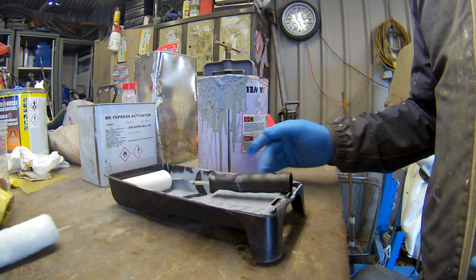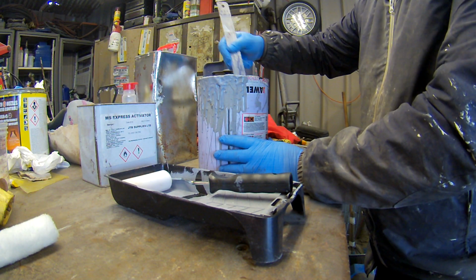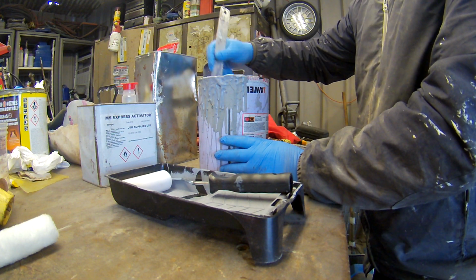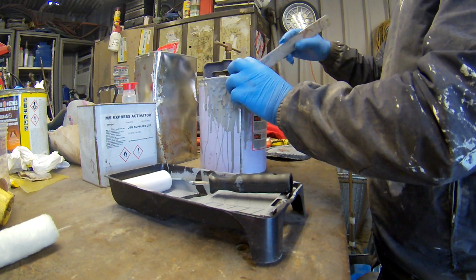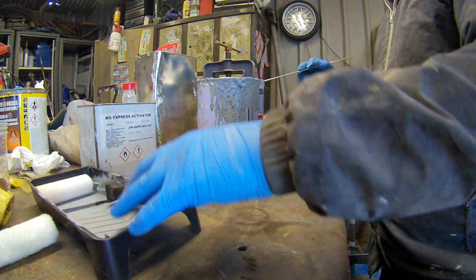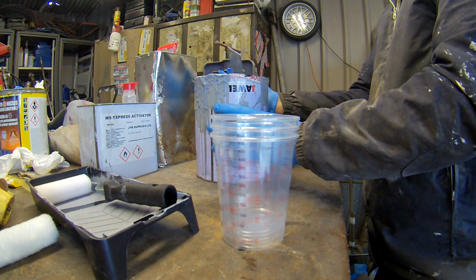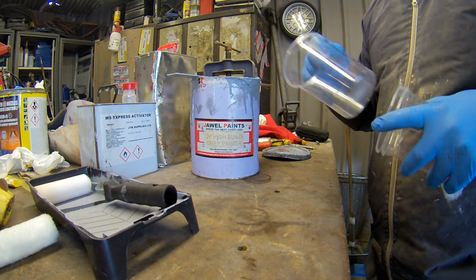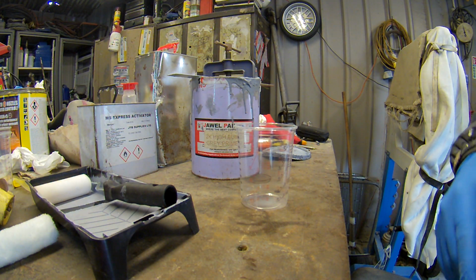You might think that's a bit strange, but I don't bother spraying stuff like this, like spot repair as I call that. And then get it nice and thick. I've got to sand it down anyway, with 320, 400 on the DA. I've got my mixing cup, 2K, which I buy off Jowell Paints. I've had a lot of stuff off them over the years, I think from Birmingham. I like their stuff.